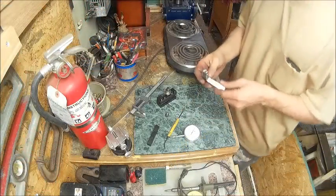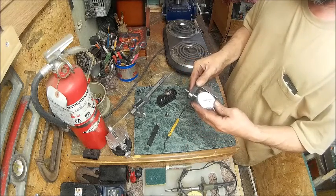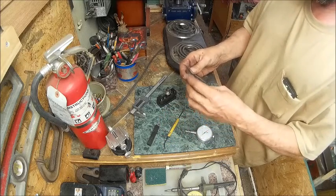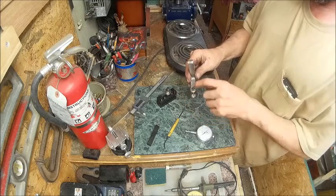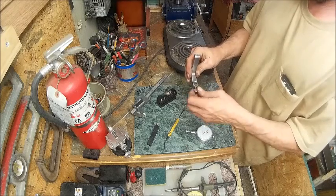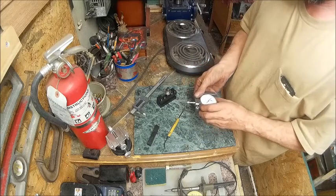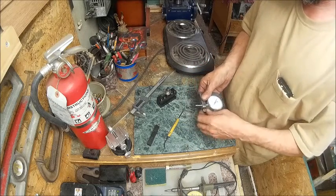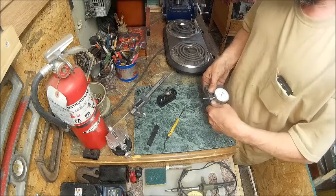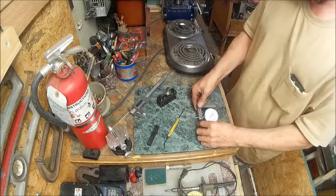Now that we've got our piece formed, I've got my hole drilled for this to slide in and out. I drilled it all in the drill press - drilled this hole first, then drilled this one and put a thumb screw in it. So now we just put that in there just like that - wherever you want it you can put it square to the back of it. There you have it. Now let's go put it in the lathe and see how it works.